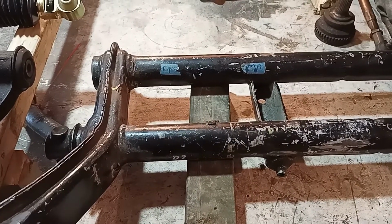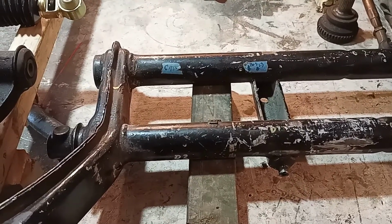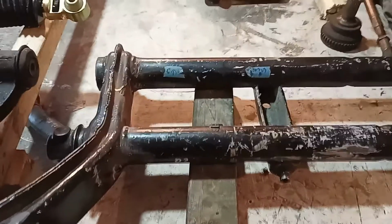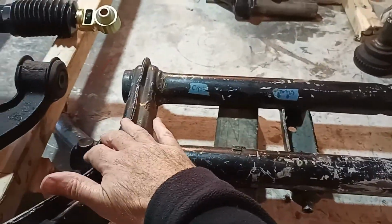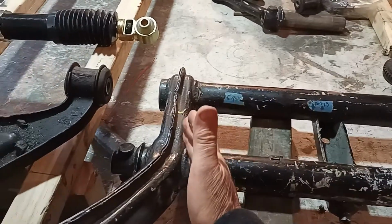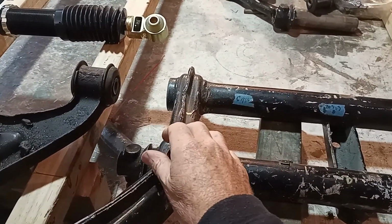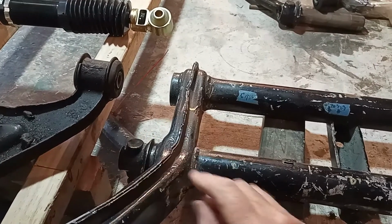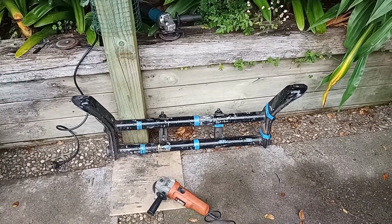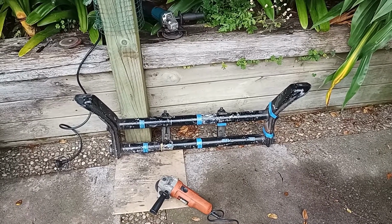This is a Volkswagen beam suspension unit that I have left over from another project. But in reality, all I'm going to use is this quarter here, maybe 300 mils of tube, the needle bearings, and just the start of the arm. This is going to disturb the tranquility of a Sunday morning.